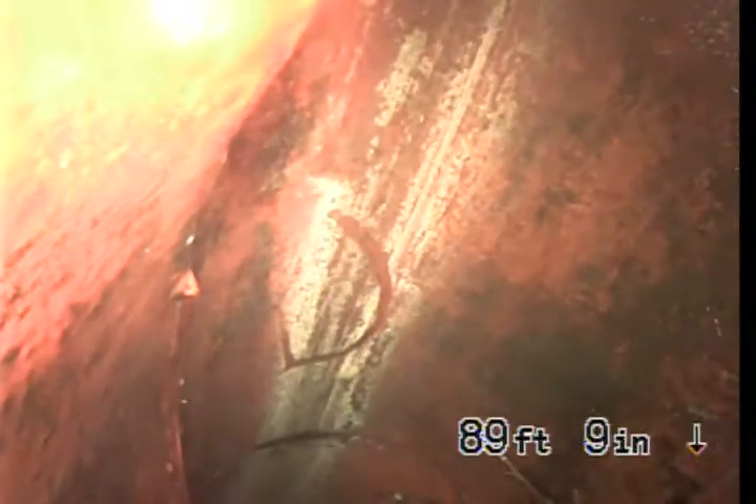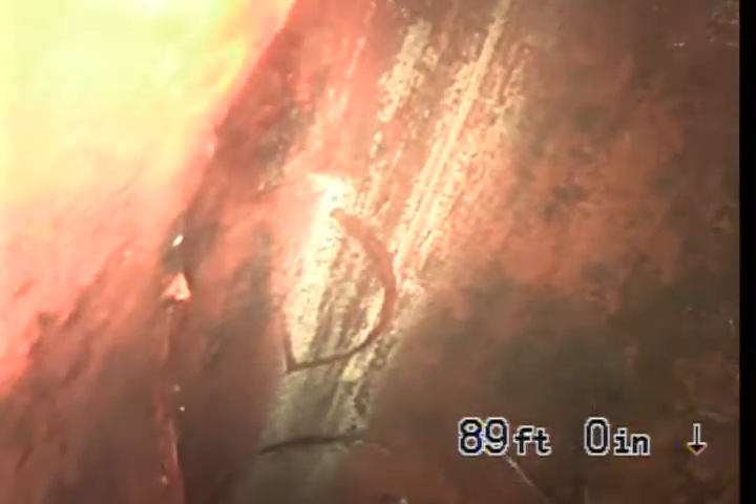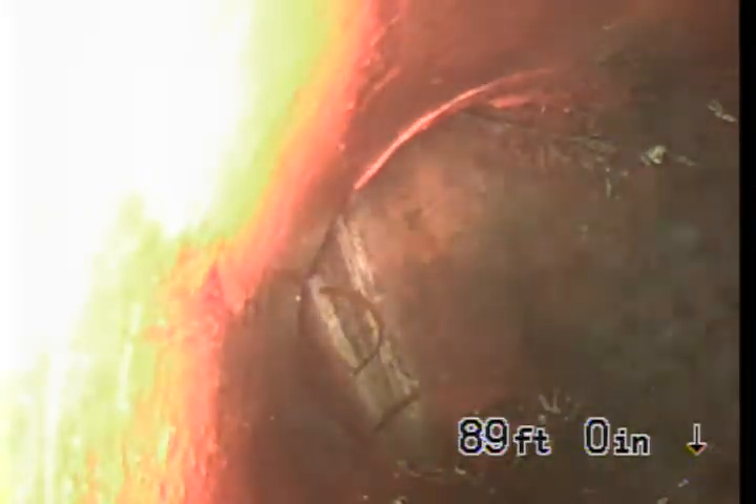It's your responsibility from the saddle — meaning where it connects to the main city sewer. So this is the city sewer, and as I pull it back, this pipe on the left is yours. You see this seam here? This is your seam. You own that. This is the most expensive part to fix — usually it's under the street, but in this case it's on your property. It does look to be in pretty good working order. The seam is all together, no separations or breaks, no roots going through it at all.